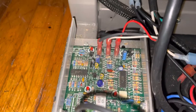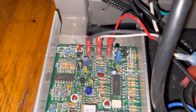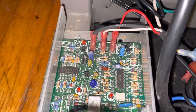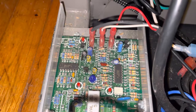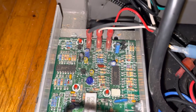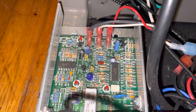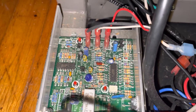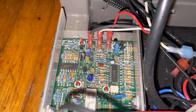That's not desirable for the goal I have planned for this device. Doing research on the internet, I found out that if you remove a particular resistor, it will start up at the same speed it was before when you last removed power. There's a safety switch with a lanyard attached to your body in case the treadmill throws you off — it yanks the safety switch out and shuts off immediately.